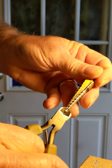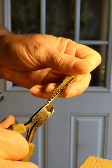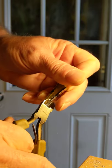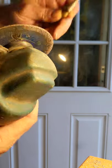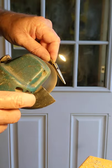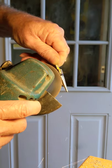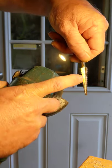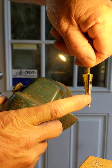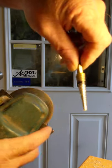Or you can take some side cutters, clip off the big chunks, then grab your angle grinder, use a 1/16-inch cutoff wheel, and just put it tight in there so you get a ridge between the cutting surface and this edge, and it'll clean it right off.